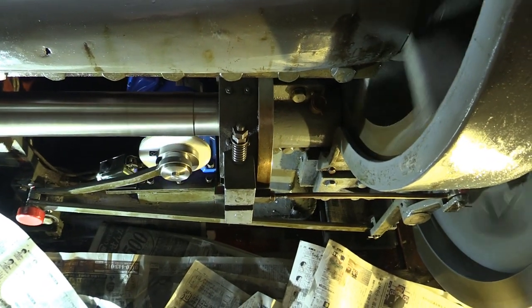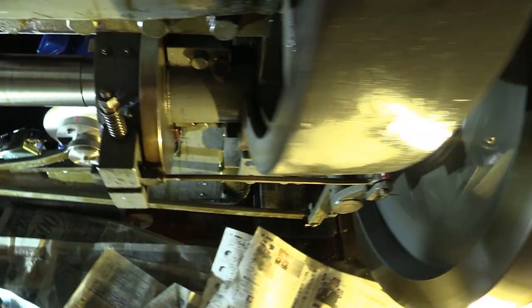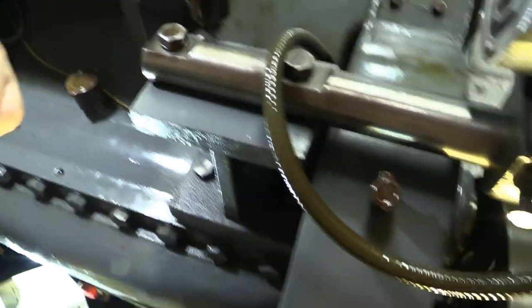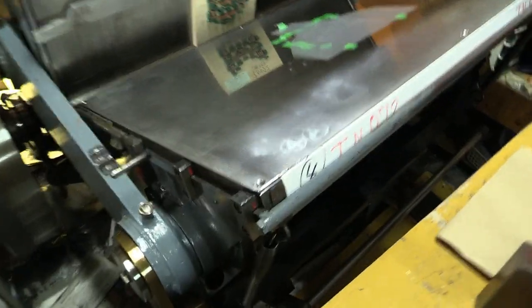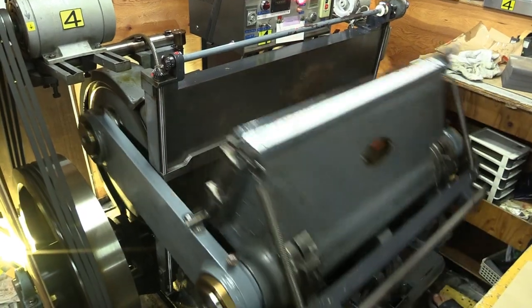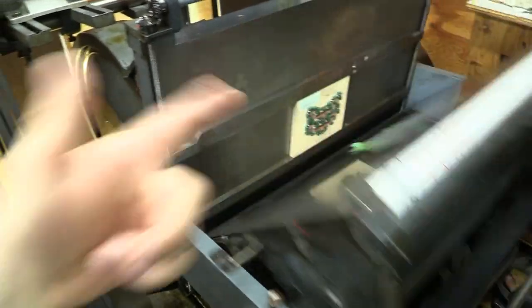Flywheel is spinning and we'll run it through a cycle. So that's one cycle. You can see that white disc rotating and the cam is moving. The clutch is engaging and disengaging, and then the brake there — you can see that brake is coming on and off. If I come up over the top I will show you the actual jaws. And that's stopping perfectly. Awesome. Problem solved. Hope you enjoyed that — if you ever need to fix one of these machines, that's how you do it. We'll see you in the next one.